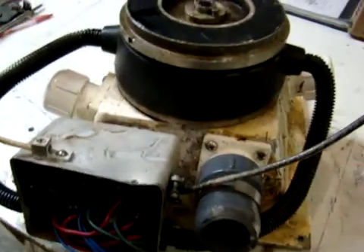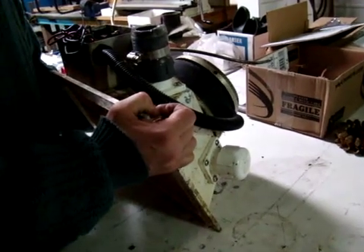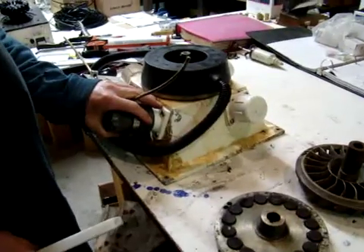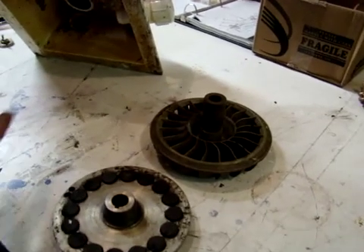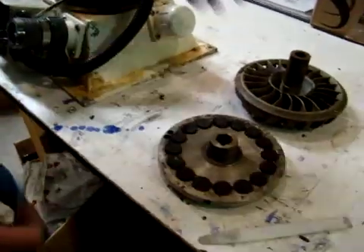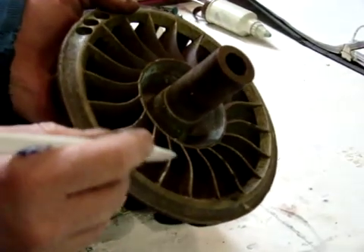Hopefully with this one, which I'm about to take apart, we won't find that kind of damage. The magnets have shed a lot of their steel casing. Here you see it taken apart. The Turgo Runner just unscrews off the bottom — it's a right-hand thread, so it screws off left while holding the magnet up on top. That's the second most expensive component in this alternator, and as you can see, it's in pretty good shape. Typically it's going to wear right in this area the most, so that's where you'd want to look as it starts to erode.